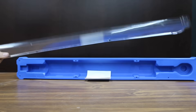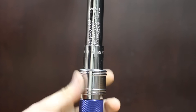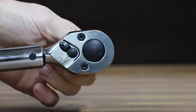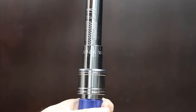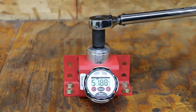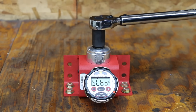At a price of $100 is the Cobalt brand. The storage case isn't as durable as most other brands, but it includes a certificate of calibration. The torque range is 50 to 250 foot-pounds, designed for clockwise use only, with a positive locking mechanism and SAE scale only — no metric. The Cobalt is 25 and 9/16 inches long, made in Taiwan. It provided much more consistent results, ranging from 51 to 52 pounds for an overall average of 51.25 foot-pounds with a standard deviation of 0.42.